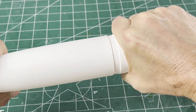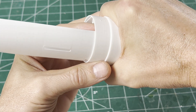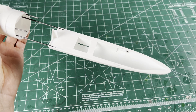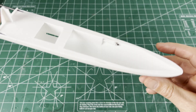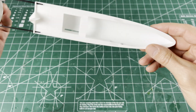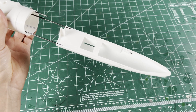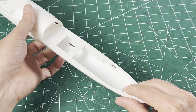Pull the radio tray forward a little and add the nose cone, and mark this maximum forward alignment of the radio tray. Now everything is marked and loosely assembled. Position the longerons to the forward marks, and with the nose down, glue the radio tray to the longerons. Once tack dry and no drips, push the radio tray into the body.